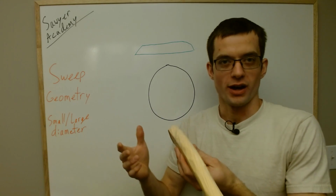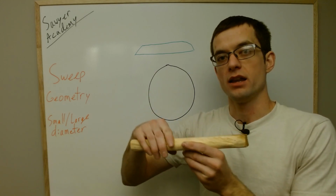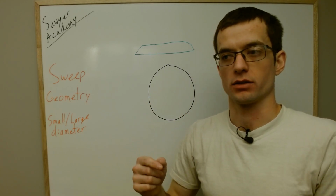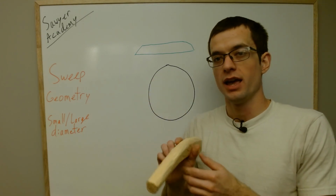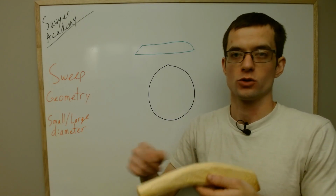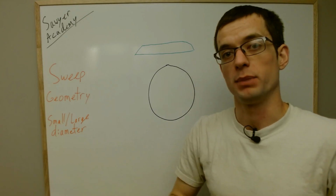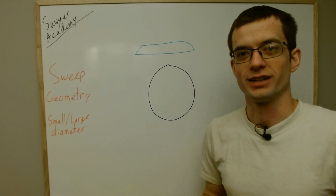So to summarize that, if we start belly up on phase 1, we'll end with belly out on phase 3. And if we start with horns up on phase 1, we'll end with horns out on phase 3. So that really takes us from 360 options down to 2 main ones. And then in your application, in my case, I'm always going to be orientating belly up. So really every time I load a log onto a carriage, I have one best possible way to orientate that log for my applications. And yours might vary, but they'll follow these guidelines more or less. I'll show a video of what that looks like now.